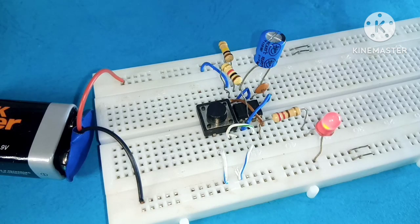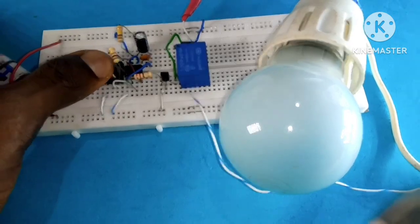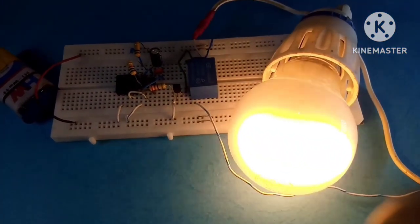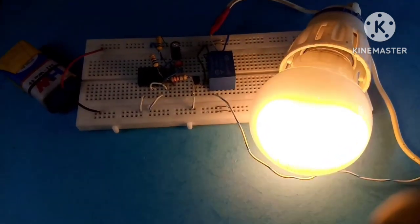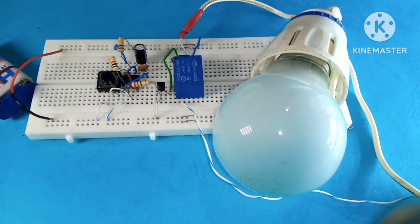You can see I have increased the time duration for the LED to stay on. You can also replace the output with a relay to control an AC light bulb. When the switch is closed, the output triggers the base of a transistor to control a relay switch — and we've just built a circuit that controls how long an AC light bulb will remain on.